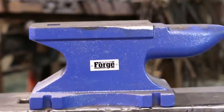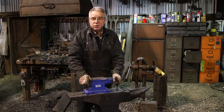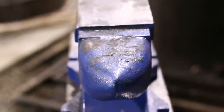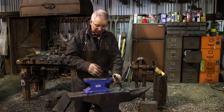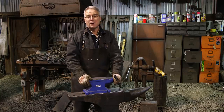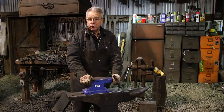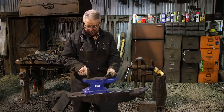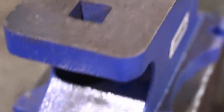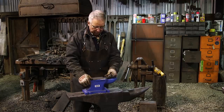Before you spend 62 bucks, here's what you need to understand. It's awkward — the shapes are not right, especially the horn. The horn is flat on top, which means it's almost not a horn, and it's really hard to get a smooth bend. Item two: it's soft. I forged one set of tongs carefully and I have deep hammer marks. After a week of forging there wouldn't be a smooth spot on it. It has no pritchell hole, only a one-inch or three-quarter-inch hardy hole, so punching through gives you nasty square edges with no pritchell — that's a problem.